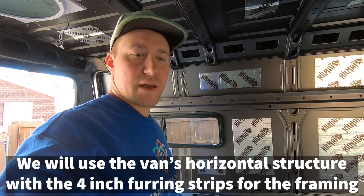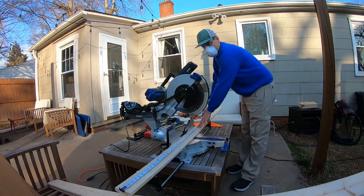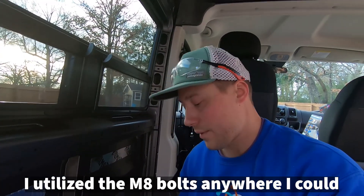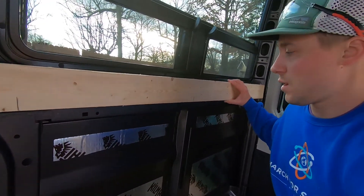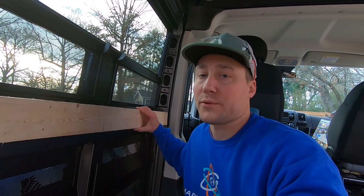I decided I'm not going to rust-oleum first — I'm going to cut some pieces of the framing members, all the horizontal members, and figure out exactly where we're going to place those. I'm just going to do some measurements and get that written down. Cut those out, drill some holes, and then we'll rust-oleum all of them together. Similar to the bed frame, this has another M8 bolt, so I'm going to drill a hole on the right side of this board and stick it to the wall. Then I drew lines where there's free space within the framing and I'll drill two more pilot holes into the metal — and that's where I'll know how to drill out my plus nut holes, the three-eighths-inch holes.